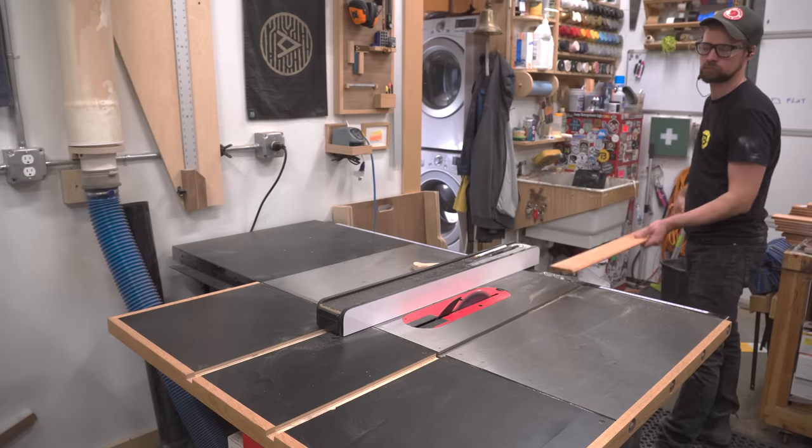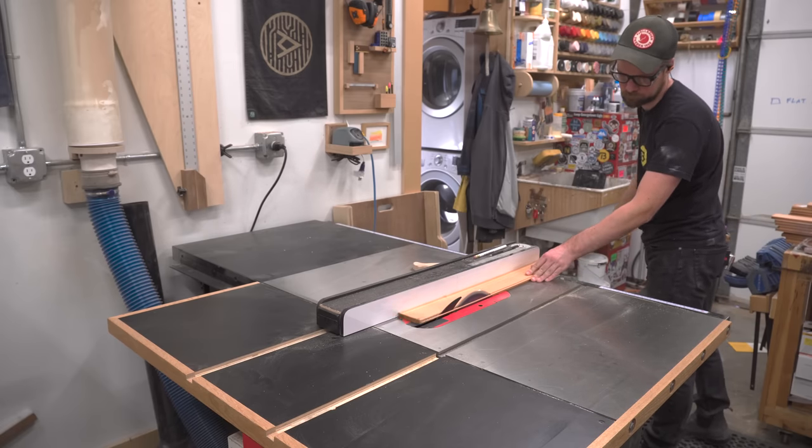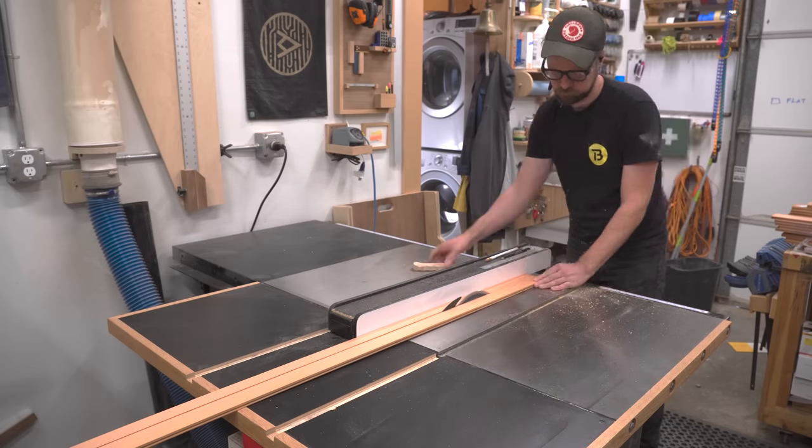This is tongue and groove, which I'm going to be using when I do the paneling, but right now I just want to trim out the door, and for that I'm going to cut off both the tongue and the groove side so it'll match the rest of the room.